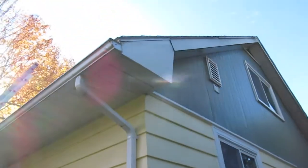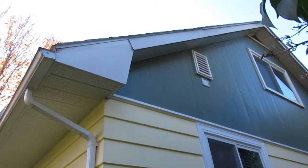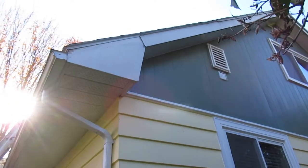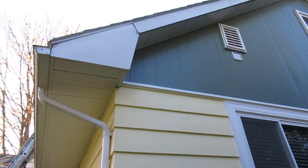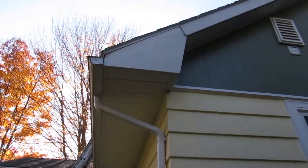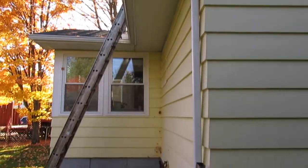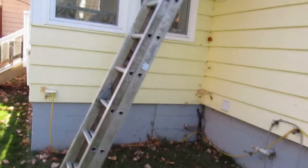I tried all kinds of different things to stop it from happening. I added a vent in the open space in the attic, about eight feet in where the knee wall starts, so we don't need to run the heating strip that far — just about three feet in. Then it has to lay in the gutters and come down the drains, but it can't touch anywhere; it has to be spaced apart. They provide clips for that.